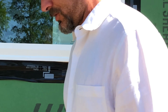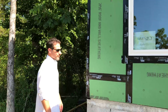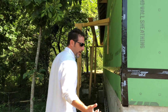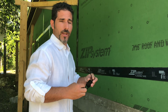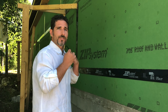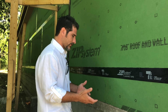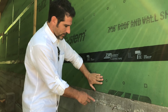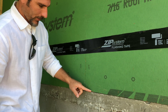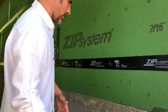I also want to show you what we see very commonly on the overlaps and the concrete. At the bottom of the ZIP system, one of the biggest things we're seeing — because we do take these homes apart and fix them, and we're already fixing ZIP homes — is that water coming down the ZIP system makes its way down here, and if the concrete sticks out past the ZIP, the concrete actually catches that water and funnels it into the inside. This is a major problem in my opinion.